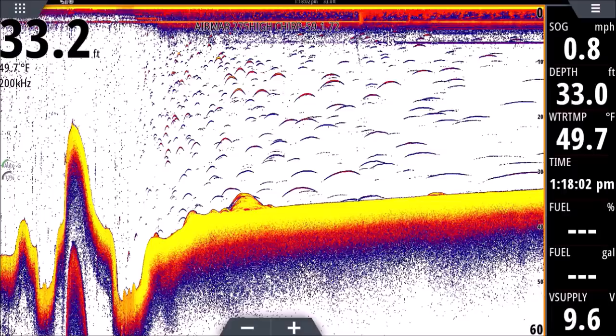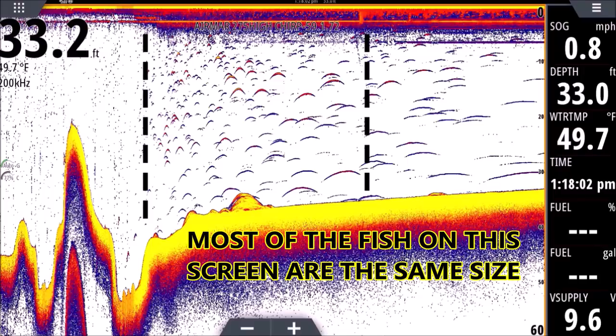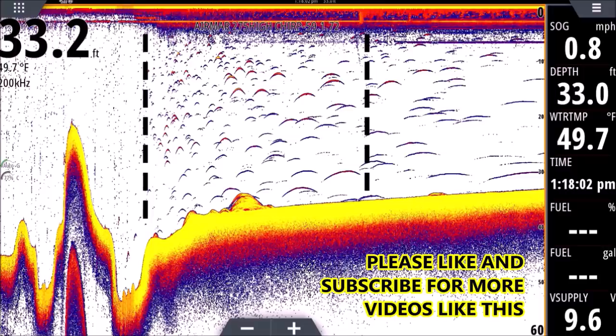Let's get started. You're going to see a whole lot of different sizes and shapes to these returns, but these are all the exact same size fish, more or less. We were in a creek channel netting shad — small, in the three-inch to five-inch range — so I know the size. I ran over them on plane, then dropped off plane to see how they would look different. As we discussed in the first session, our transducer sends a ping down and waits for it to return. Anything that interrupts that ping shows up as a return.